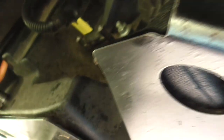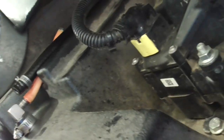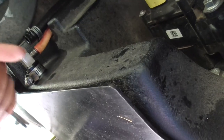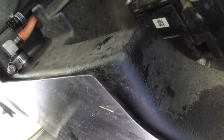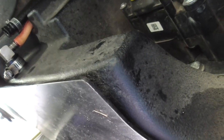About a year or two ago we had a John Deere tech come out. There is a screen under the fuel tank — this orange line is to keep the diesel from coming out — but this line here is actually a screen that goes inside the tank and it was clogged up. The tech replaced it, but what happened was the screen had fallen off the end, which allowed trash to go up into the filter.